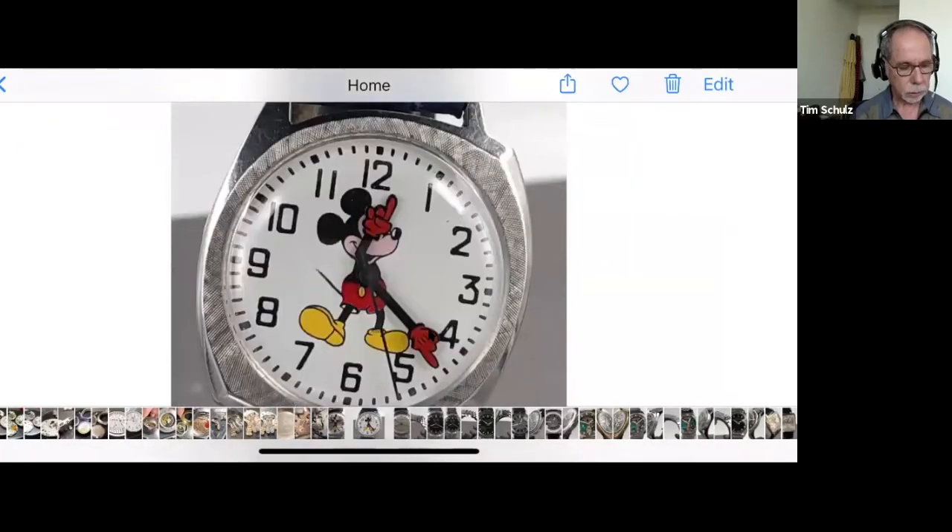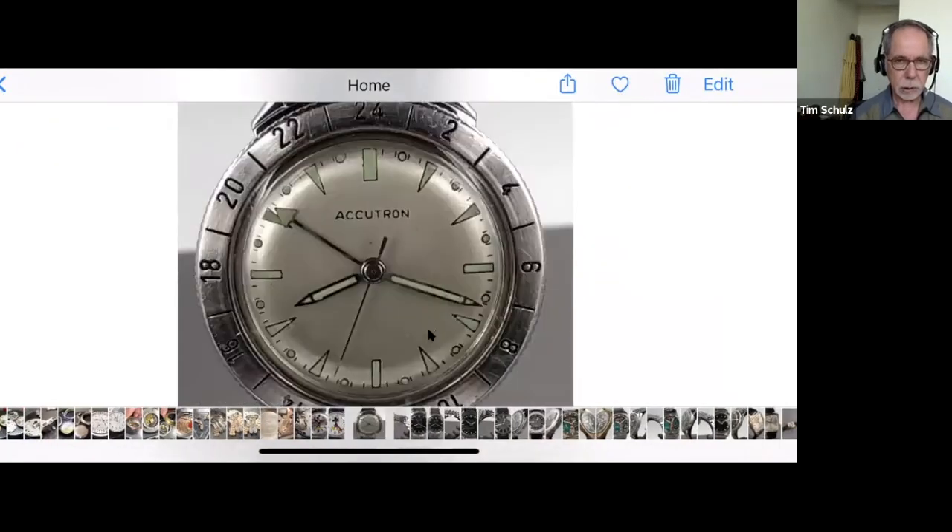It's a totally crazy design, but it didn't violate the Bulova patents. And that's the last tuning fork watch that Max Hetzel had designed. This is a watch that Chris serviced for me — that's a later, actually 219-based movement, a Mickey Mouse. And then this is another one he serviced, a 214-based. And then this is the Accutron Astronaut — it's got a third hand added, a 24-hour hand.